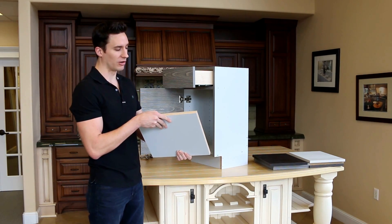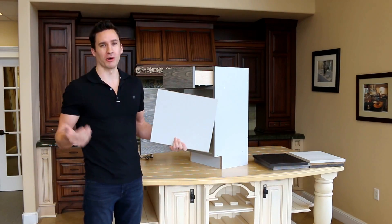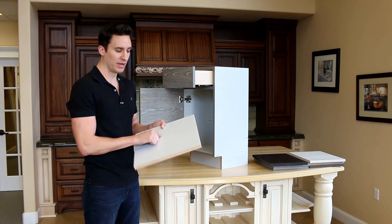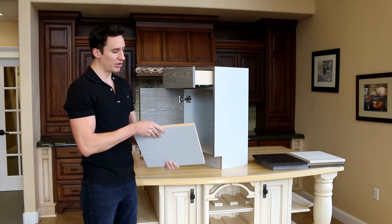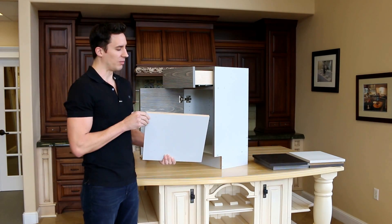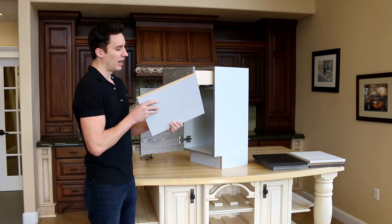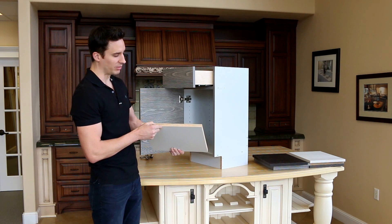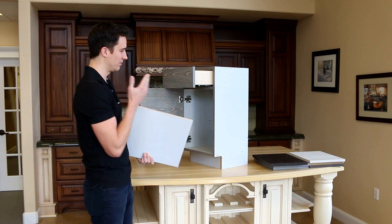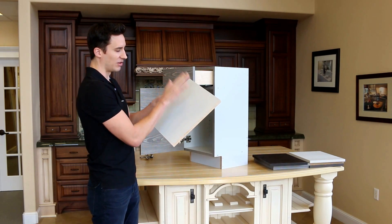I went down to a place here in Oregon and asked where the best cabinet case is made - in my opinion, it's Oregon. This company is based in Portland, Oregon. I drove down to Medford and talked to the people at the plant where they make the plywood. I said I want the laminate face, but what you guys normally do is use it on a particle board core - and I didn't want particle board because it just breaks apart on cabinet case construction. So I had them put together a brand new interior material, which is basically a plywood core. That gives us the screw holding strength and durability we're looking for. You can see the nice plywood core, and then we have the durable laminate face. This makes a really clean interior that you can clean easily and it doesn't scratch up.